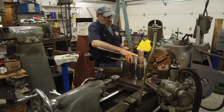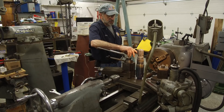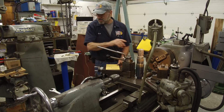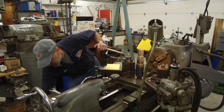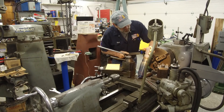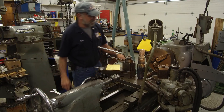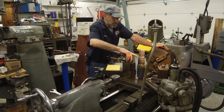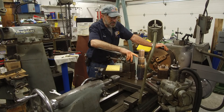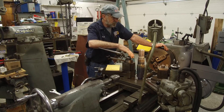That's where we get the 15 thou. We know there's relief under here and to get this tooth all the way through, the cut does go somewhat into here. We didn't test this area to see if it's annealed as well, but we were putting heat to that point. We're going to machine this down, dress this radius, kiss this edge right here, and that will be our area for weld buildup.